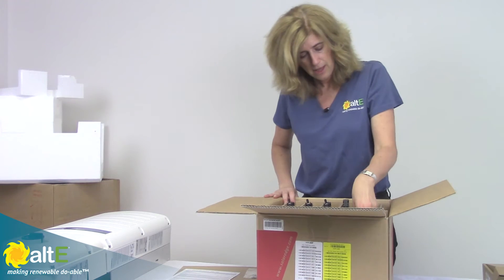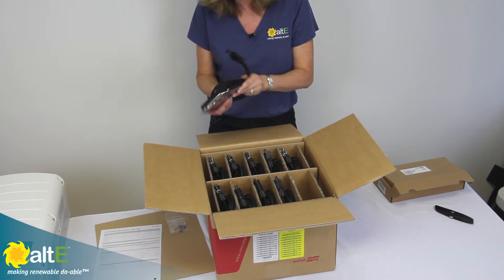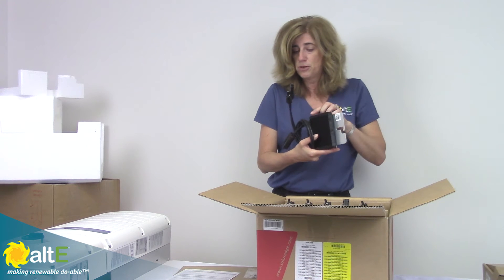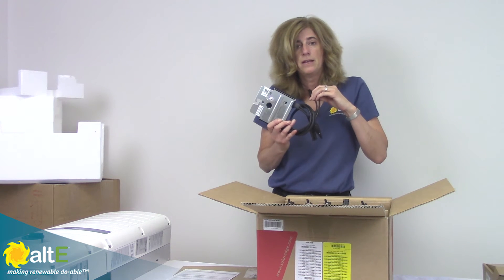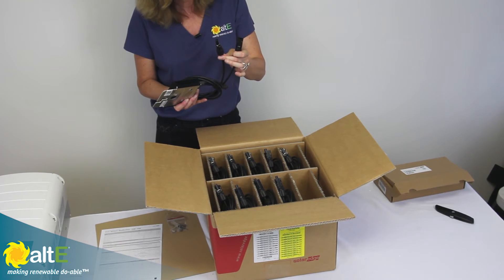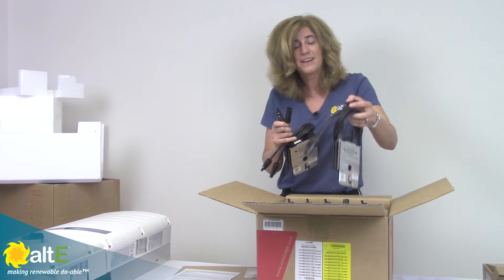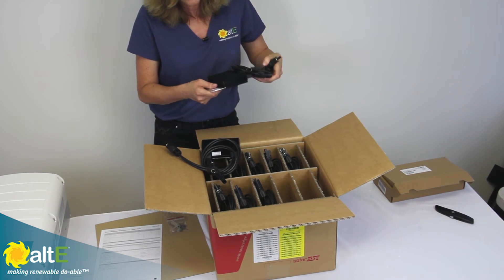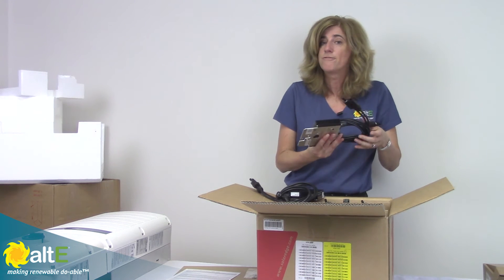The optimizer is just a tiny little box — it's actually a little bit smaller than a microinverter. What it does is take the DC output directly from the solar panel; it does not do any of the inverting. It's available with MC4 connectors or H4 connectors depending on which solar panels you've got, and it connects right to the existing cables from the solar panel. The output then connects to the next one, and you wire these all in a string — up to 25 in a string for 210-watt panels, or up to 18 in a string for 285-watt panels.